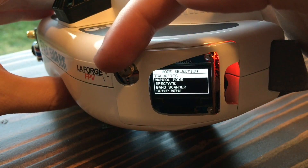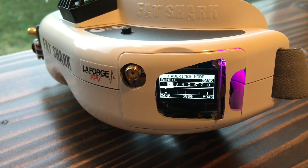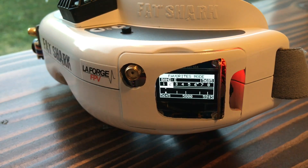So if you notice I don't have any antennas on — that's just because the idea is you're balancing the two receiver modules. If you were to put on an antenna you'd run into the differences in dB between your two antennas selected. So this is just the best way to get a level playing field.